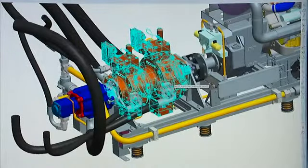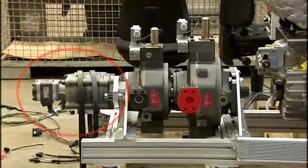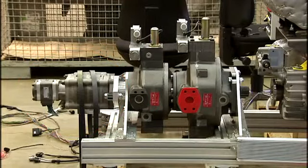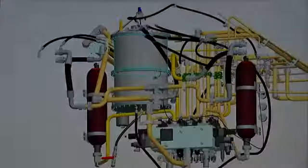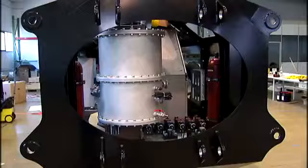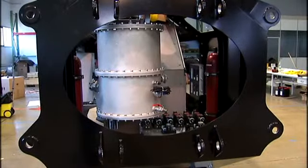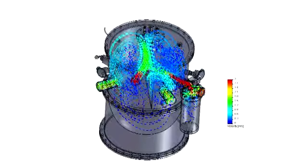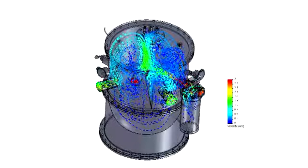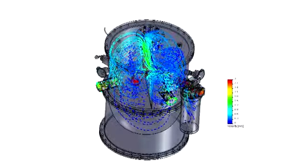Hydraulic oil is supplied to the hydraulic system by means of two large radial piston pumps, shown in orange here. The two rear hydraulic pumps are fitted exclusively for cooling fluid. The hydraulic oil tank is another tailor-made product manufactured by Solner. For reasons of weight, the tank had to be as small as possible. The use of special CFD software tools at the development stage enabled us to reduce the oil reserve to just 21 gallons.